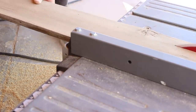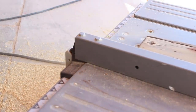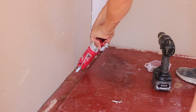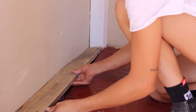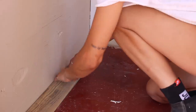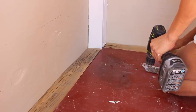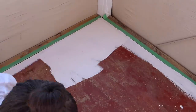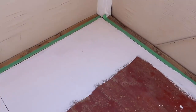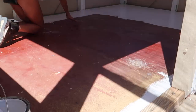What you saw me measuring for was pieces of pallet wood I needed to cut down to replace the bareness of the trim of the shade room — a fancy way of saying there were some holes on the floor I wanted to fill up. I wanted a little bit of texture and a more chic look, and that's where the pallet wood came in. To secure it to the floor I used exterior construction adhesive and finishing screws that kind of hide perfectly within the wood. I continued that around the entire thing before painting the floor.